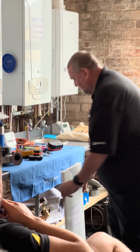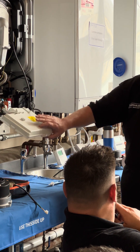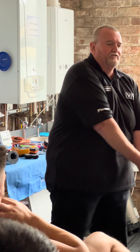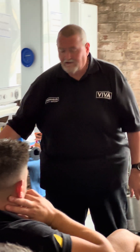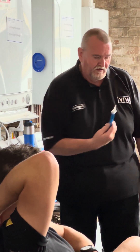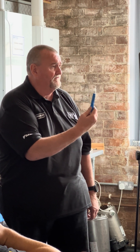I've proved the case is safe, so I can drop the front down. If I want a quick check — have I got voltage going to my pump, have I got voltage going to my fan, have I got voltage going to my diverter motor — I can get my Volt Stick and put it in there. That's great for keeping me safe, but not very good for confirming whether I've actually got voltage.